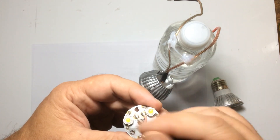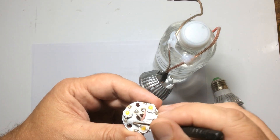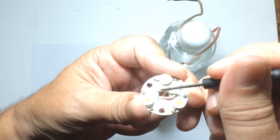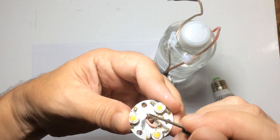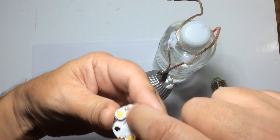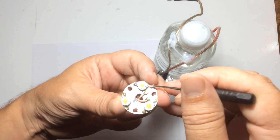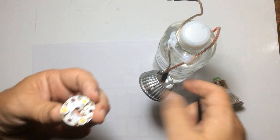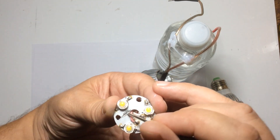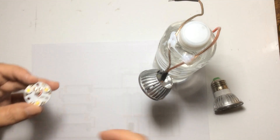There is a track between the positives — these LEDs are in series and they're probably around 3.6 volt LEDs, putting up over 10 volts with the three of them in series. What you need to do is cut both of those tracks. I've only cut one in this instance just to show the difference. There is a track that makes all these LEDs in series. There is one main positive and one main negative, and what I've done in this light is cut both those tracks with a small mini grinder — just cut the track clean out so it's no longer in contact.